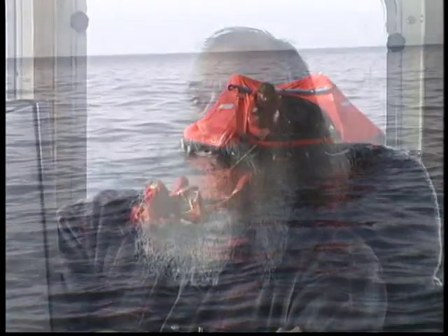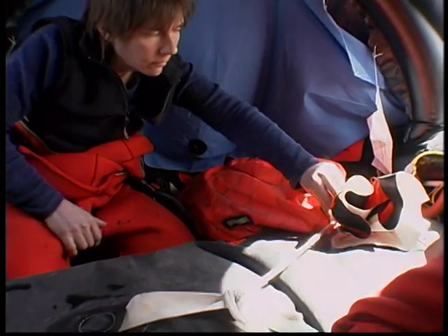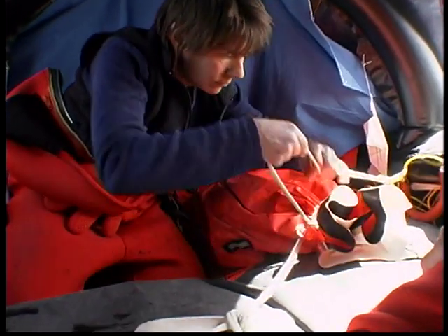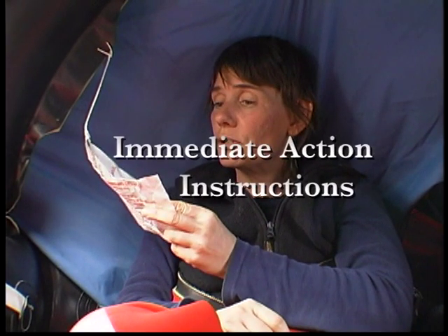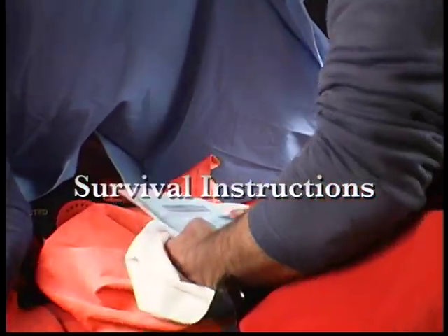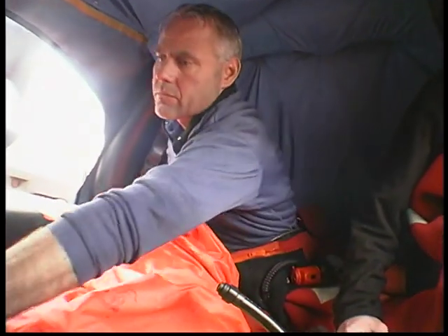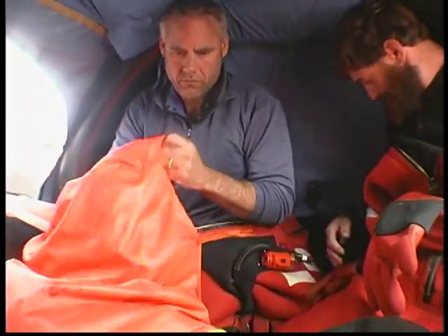Use the rubber ring or coil and line that is always found near the life raft opening to throw to a person in the water. When we were in the raft, we made sure that everybody was safe, then we looked around for things floating from the vessel — packages of lunch meat, and even a survival suit. Find the equipment bag, which is tied onto the floor. Follow the immediate action instructions. Locate the survival instructions in the pack. It is vitally important to secure the contents of your survival pack at all times — loose items can be lost, damaging to you or the life raft, or swept out the door by a wave.